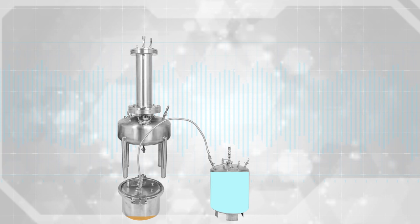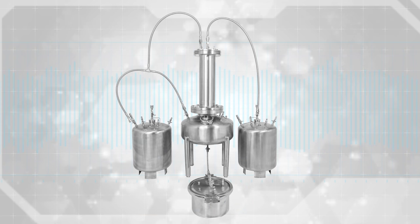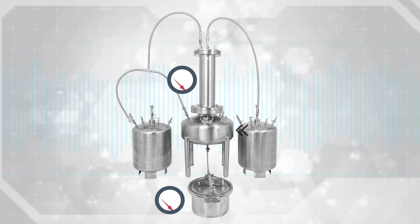The sucker tank also serves as a dryer tank to clean your final product of all residual solvents. Step 8: Re-sealing and pressure checking any open tanks. Any open tanks will need to be pressure checked again — this will be the sucker tank once cleaned and resealed, and the column once filled and resealed. They are pressure checked again each time because those are the tanks that have had their seals broken. If you do not drain your extract from the extractor tank into your sucker tank, you will need to reseal that tank and pressure check it after removing your extract. Choosing not to drain your extract from the extractor tank into the sucker tank is not recommended for safety reasons, as well as inconvenience, time, labor, and overall cost.